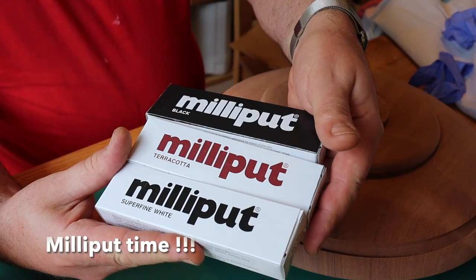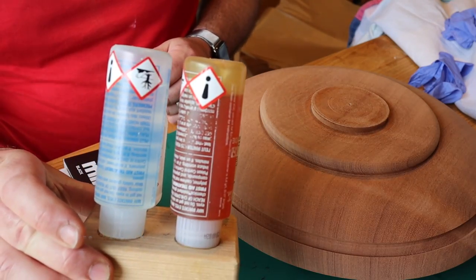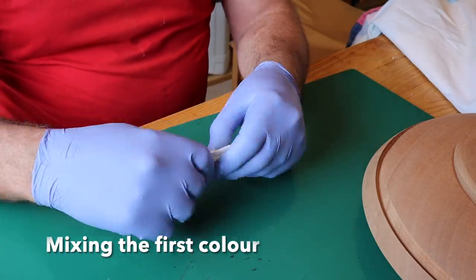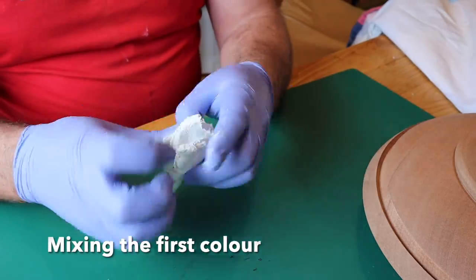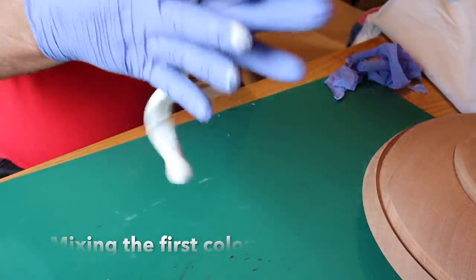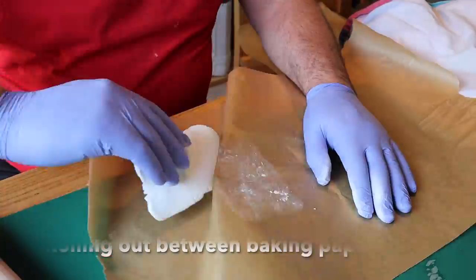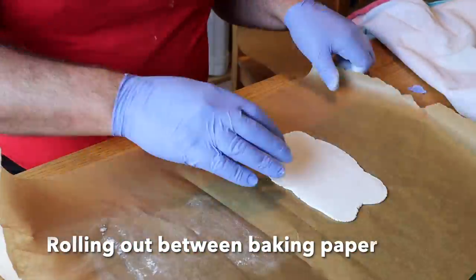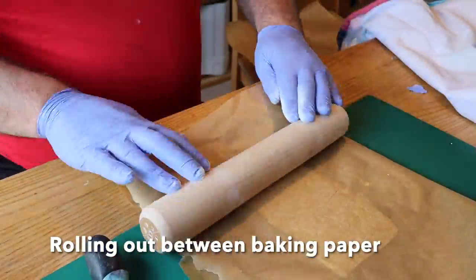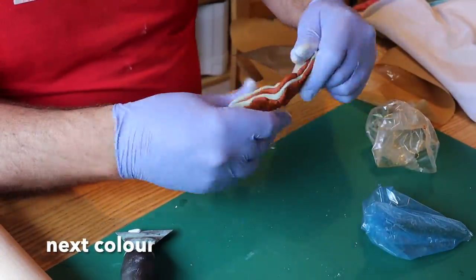Here's the old milliput — black, white and terracotta for this one. The terracotta goes well with the sapele. I'm also going to be using a bit of epoxy resin. So it's a two-part epoxy putty. I start by mixing the lighter colour first, so I'm doing the white. White is quite tricky to mix because it's difficult to tell when it's completely mixed, but if you mix it for a good five minutes, then I'm rolling it out flat between sheets of baking parchment and creating roughly a rectangular shape. I then put this in the fridge to keep it cool, to just slow up the set a bit.